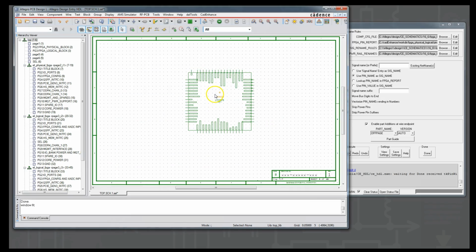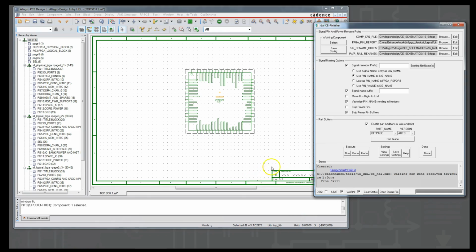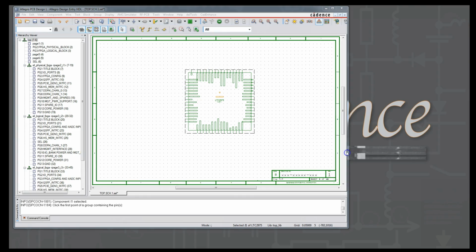Here we'll quickly go through the operations to produce wires in all 4 directions on this part with top, bottom, left, and right pins. Here we show the detail of adding wires on the left side. We start the box above and to the left of the top left pin we want, and finish the box below and to the right of the bottom pin. Then we set the direction by clicking out to the left.